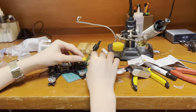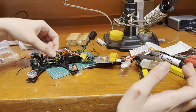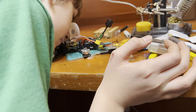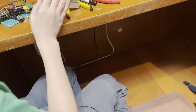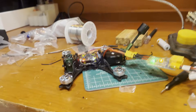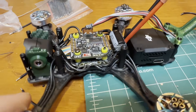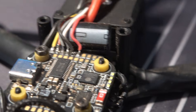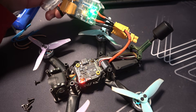With the first soldering portion completed, I wanted to test my work. I tried powering on the drone with a smoke stopper, but it would not power on. I was worried I might have shorted something, so I checked the stack for smoke. The issue was actually user error — I hadn't turned on the smoke stopper, so electricity wasn't actually flowing. I tried again with the smoke stopper on and everything powered on perfectly. Then I had to solder the DJI O3 to the flight computer. Those pads were absolutely tiny and nearly impossible to solder, but I got it done. Testing again with the smoke stopper revealed no issues, meaning I could proceed to programming.